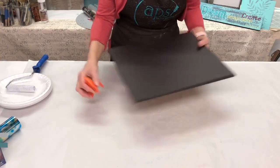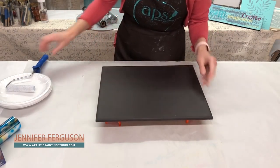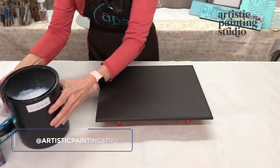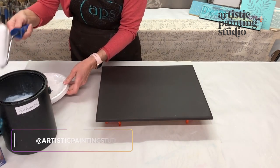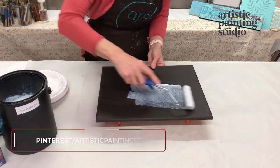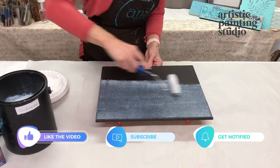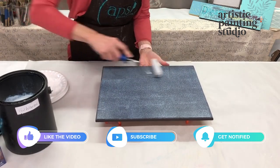To get started, I'm incorporating foils with an epoxy finish. The first thing we're going to do is put on a layer of foil adhesive. It's milky white to start with and dries perfectly clear. We're going to roll on one full coat using a low nap roller — about a quarter inch nap. We're working on MDF that has been painted already with a base coat that's like a dark chocolate. I always like using dark paints underneath my foil.